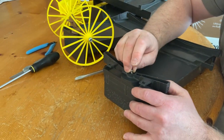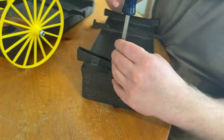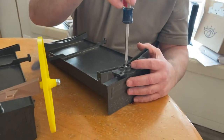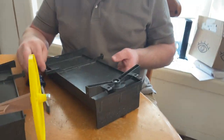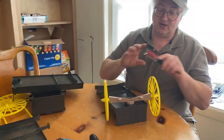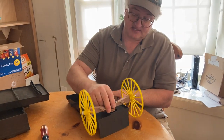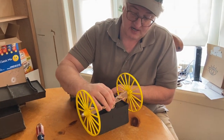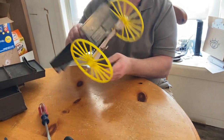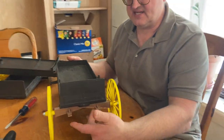There are a couple of different ways to do it. If you want it to be permanent, you need to get a wood screw — probably about three-quarter of an inch long. Generally what I do is take this, locate it on that center hub, and then just push it in there and it seats itself. I don't generally do anything else other than have that seated.